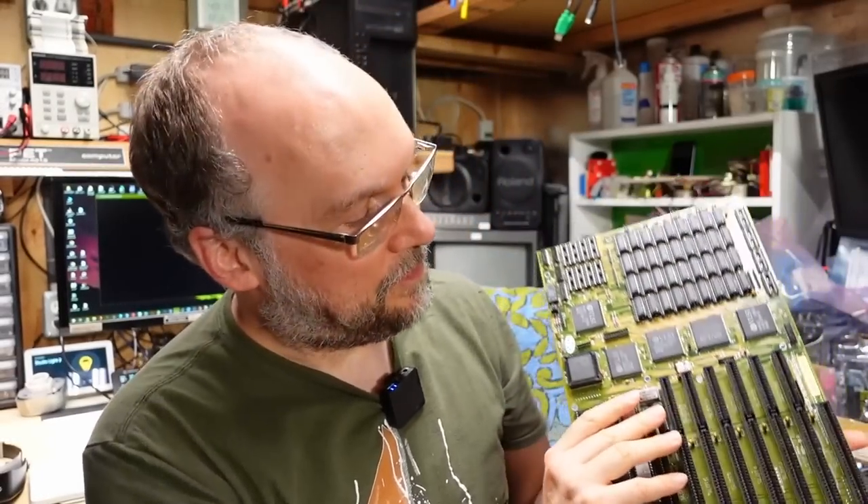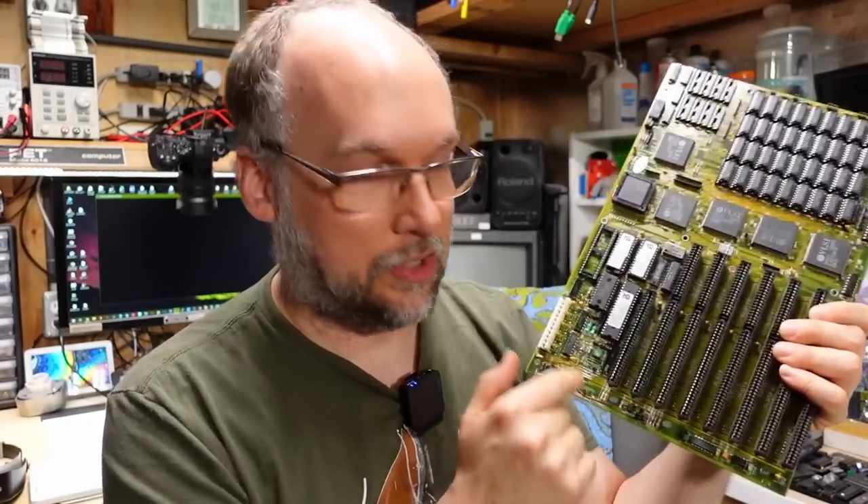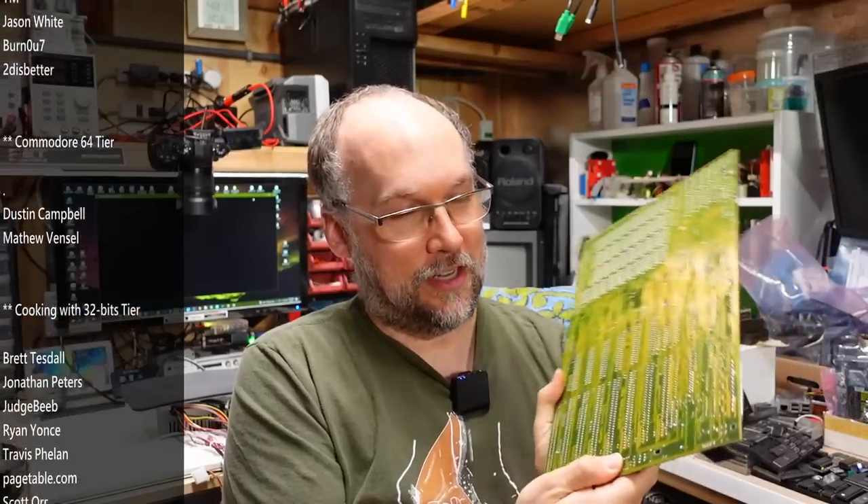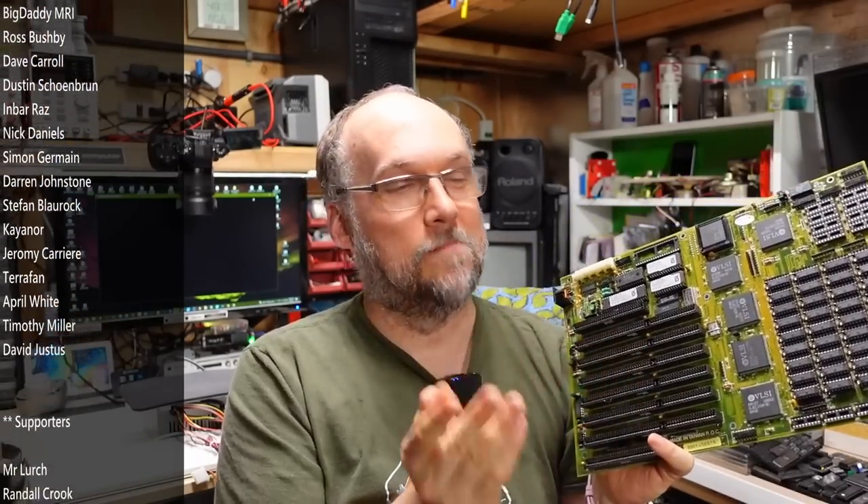Now of course the way I went about repairing it with these little bodge wires was all very silly. There are many different ways to do this type of repair. Basically, all you need to do is figure out which traces are broken, and then bodge them up somehow — whether you do it on the back with bodge wires or on the front like I did, it's totally up to you. All that sanding I did, you don't really need to do that either. I've repaired other motherboards where I just scraped enough away to tell it was working or not, put some nail polish on it, and it worked. I'm sure there's going to be lots of comments about better ways of doing this.